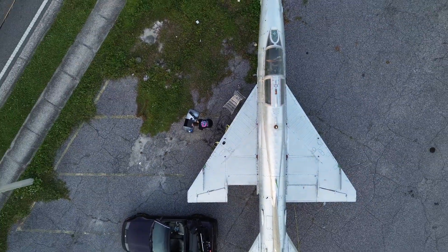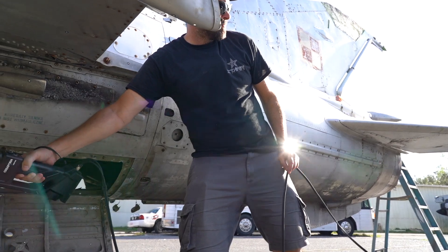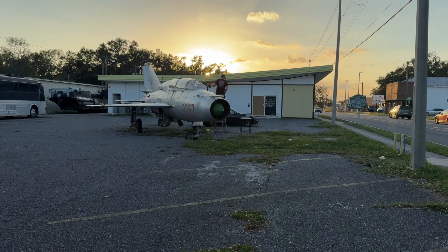Other than that the system goes through and puts all the scans together on its own. The reason there are multiple scans is that this was my first time using this scanner and I wanted to scan the whole jet as one big chunk, but it turned out the jet is a little too reflective. The scanner needs to be able to read its lasers and see them in order to tell what the surface is doing to make a 3D model, but if the surface is so reflective and the sun is in just the right spot it overwhelms the scanner — it can't differentiate the lasers from the brightness. To save time I scanned all the parts not directly hit by sunlight first, then when the sun moved to a perfect position I scanned the entire other side as one big scan. These are just things that happen when you're scanning something this large for the first time.